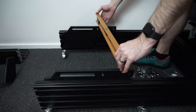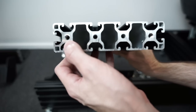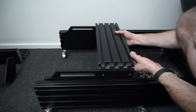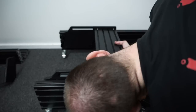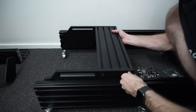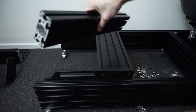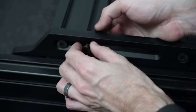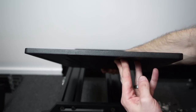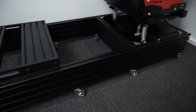It's a good idea to quickly run a spirit level across the top just to make sure everything's completely flat before you install your cross members. These cross members have M8 threads tapped on the outermost channels, making it very easy to screw straight into position using the M8 bolts provided. The screw holes will only line up on the 40 by 160 piece included for the two tapered screw holes, so install the 40 by 160 closest to you. Get your bolts inserted finger-tight — don't fully torque yet as there is still a piece of 40 by 80 to install on the front.